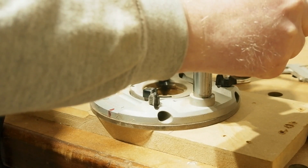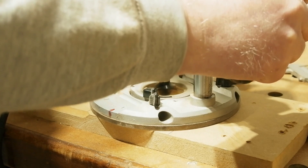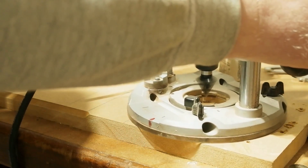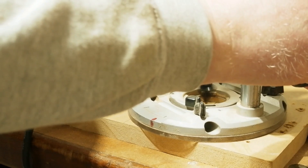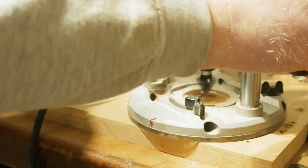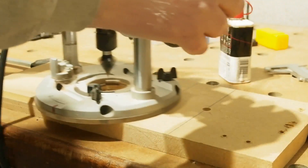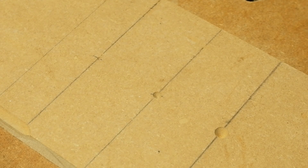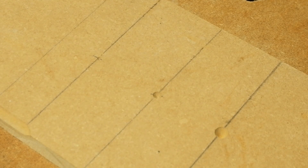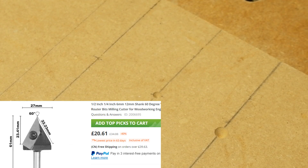There's a good reason for the vibration which I'll talk about in a bit. The second thing I noticed, in the scenario I have set up here at least, is how easy it was to spot the point of the cutter to the mark. Unlike the more typical 45-degree groove cutters, the steep 60-degree angle just means you're more easily able to eyeball where the point is. Here are the three very clean starter bores — you might do something like this in laminate or aluminium to open up a marked or punch point, giving a drill bit a clean and accurate start.